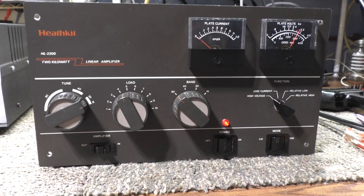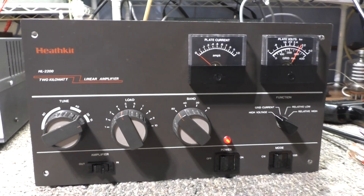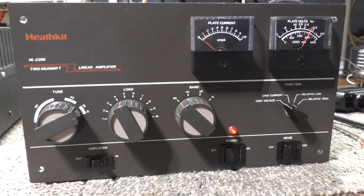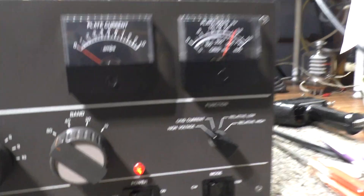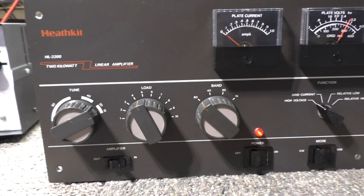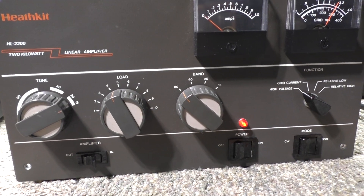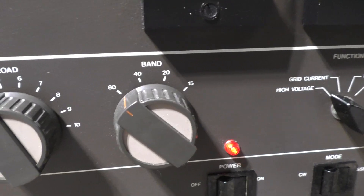Before I button her up, I'm done playing with the Heathkit HL-2200 — basically a Heathkit SB-220 redressed to match the newer Heathkit looks and line of equipment. Other than the looks, it's basically a Heathkit SB-220. A later model, originally this had 15 through 80 meters, and when I bought it, it was set up for 6 meters only. We had to do some playing around switching the tune and load caps because they were 6 meters, and we switched it over for 10 meters. So this amp will work on 10, 12, and 15 meters now.